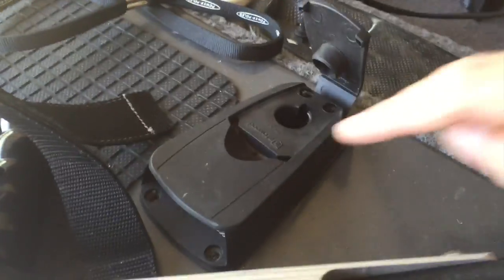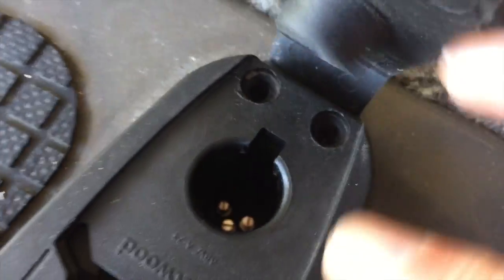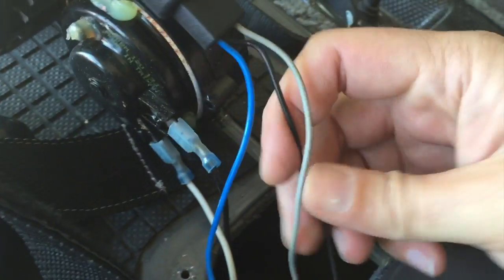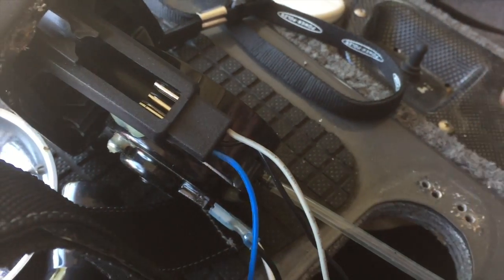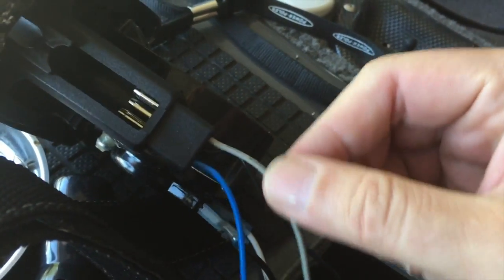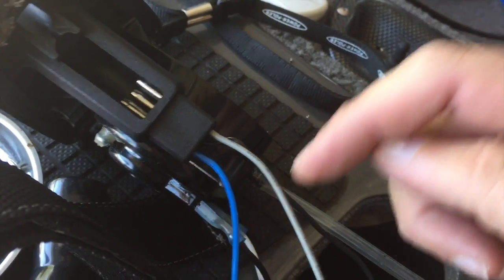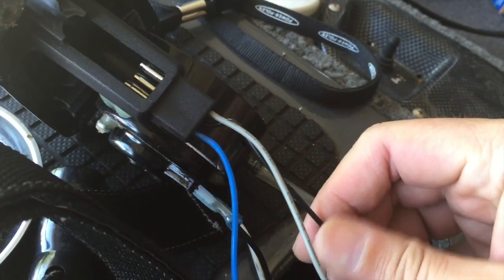I'm going to actually wire it into the existing pole. There are three pins down in here, so I unbolted it and pulled it up. This is your horn, and this is the actual wiring that goes to those pins. The black is your ground. The blue one goes to a little light on the back of my pole with an on-off switch — it stays hot all the time when the key's on. This one's hot when I turn my switch on for my navigation lights. So I'm going to tie in this power wire and this ground for my LED kit, so when I flip the switch, the lights will come on in the front.